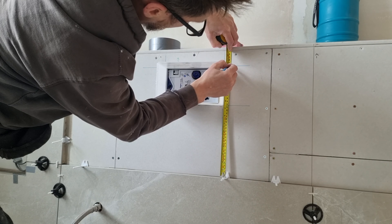Now we're ready to grind. I'd always use a corded grinder for big cuts as cordless grinders just don't have the same power. Here I have a Bosch slimline grinder with a 4-inch diamond porcelain blade. I start by just going through all my lines a little bit — this is just to alleviate pressure on the tile so it doesn't break through load in one area.